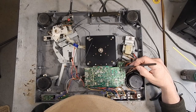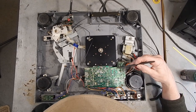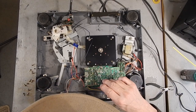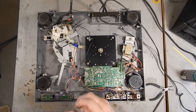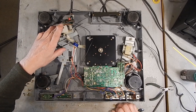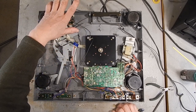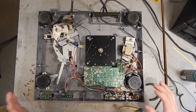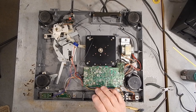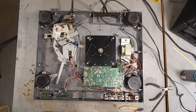It's nice that the board is marked — sections are labeled too. This is marked power supply, this is marked servo, and this is marked motor drive. These are potentiometers. These are our signals from the cartridge, and the only connection to the main circuitry looks like a ground, so the audio side is completely separate from the drive side — which makes sense. What I don't see is any sort of speed sensor. I'm going to pop this board out and take a look at the other side for obvious problems.